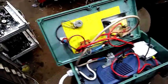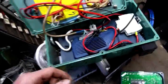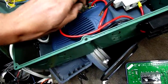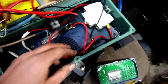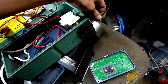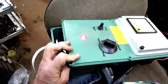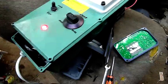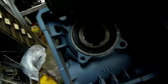That's what's inside my current speed controller. I had a look at the bits of loom floating around and it's all past repair — not reliable enough for a test. So I'm going to disconnect this Curtis controller and just stick this one in place of it. I made it fairly indestructible. This box runs any 24 volt DC motor — it's got a terminal block and you just wire it up accordingly. Let me just demonstrate using the old controller — main power connected to the batteries, forward on.